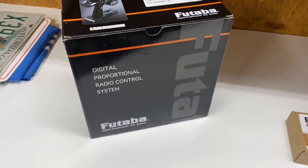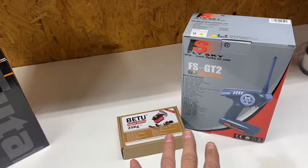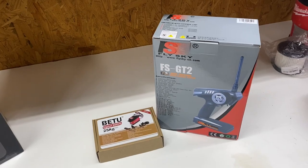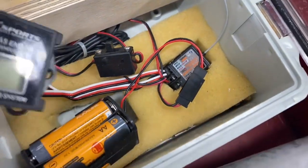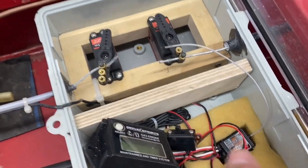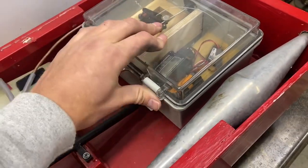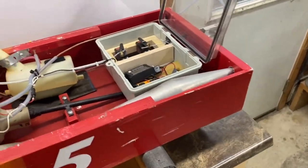You can get into something fancier like a Futaba — there's all kinds of name-brand Futaba or JR systems out there — but for what we're doing, this is simple and easy. If you happen to have one of those or want to run multiple boats with the same controller, those are nice because you can program more than one boat to run off the controller, whereas this controller is just going to do one boat model at a time. So let me show you how the electronics are actually hooked up. The receiver is this little box right here. You plug in a battery pack and a switch for power, and then this is the antenna that receives the signal. Then you plug two servos in — one for steering and one for throttle — and it's just that easy. This little box to put the electronics in I buy on Amazon; it's nice because it opens very easily with a latch and it's watertight. No matter what you do, you want to have your electronics in a watertight box, because you will flip the boat — if you run it long enough, you will flip it.